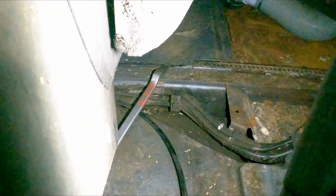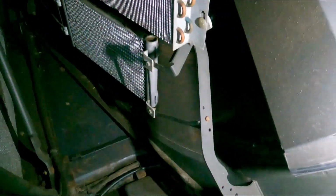I'm not sure if you can see that, but there's a rolling brush in there, and it's pushed onto the cage with a spring, and you have to make sure that that is actually still making contact. You can see at the front here that the little bristles push through, and that just pushes organic material off the cage so that it can get vacuumed off. And then obviously checking that the distances and tolerances are all looking good, checking that nothing's loose.